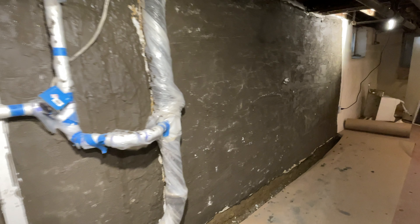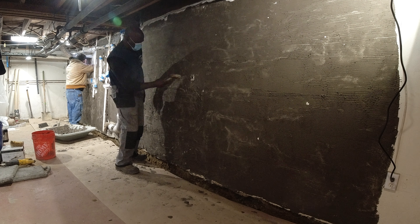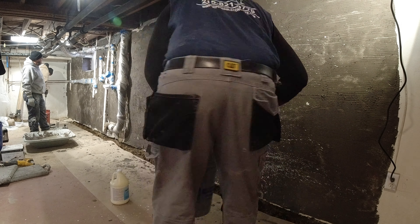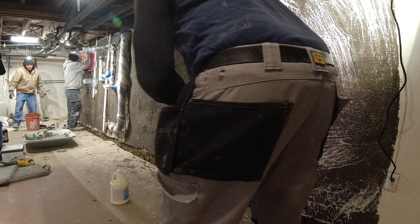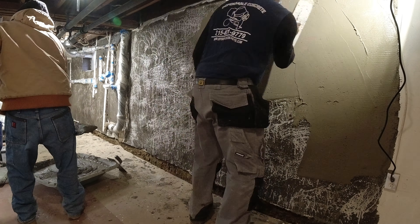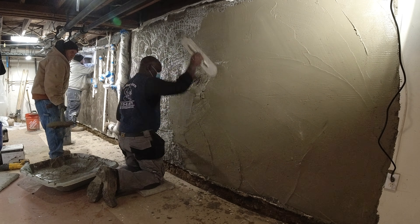What you're looking at here in this scene is the scratch coat — this is the first coat. What we like to do is anything sticking out of the wall — screws, nails, pipes — we like to hammer them in. We're putting on the glue. The glue is very important to make the last coat stick to the first coat. The whole goal is to make sure this cement doesn't crack. In our cement, we have fiberglass fibers.